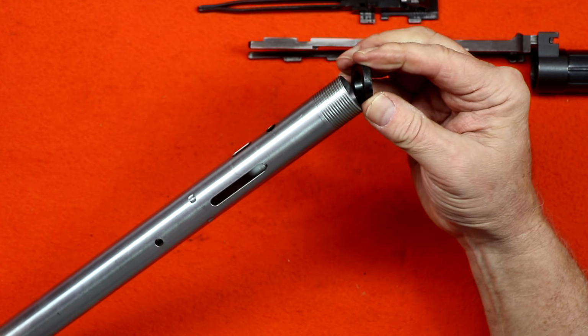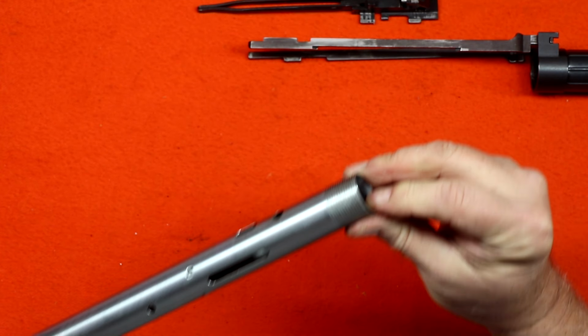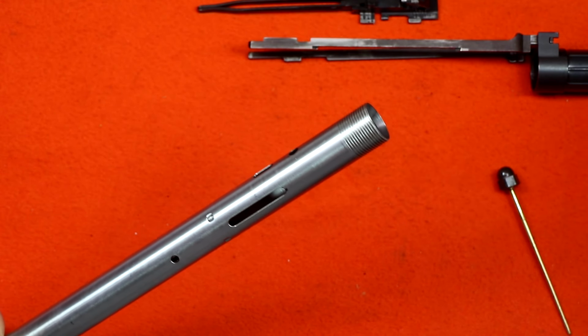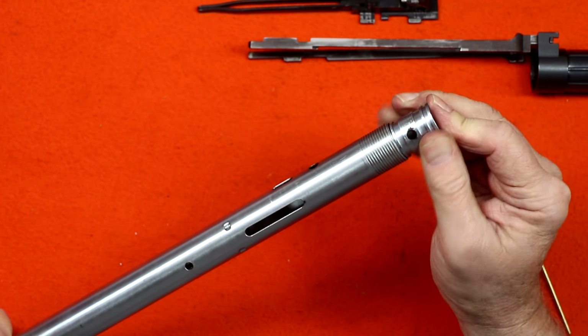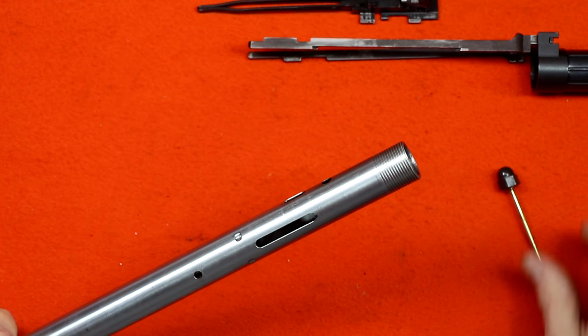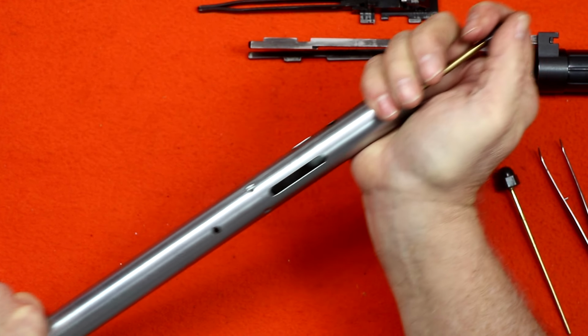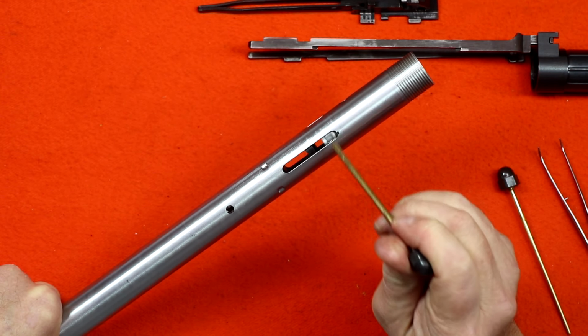The shock absorber fits snugly inside the tube, so once I get it started, I'll use that piston to push it right down against that steel washer, and it will hold the steel washer in place because it does fit snugly. I'll leave the piston and compensator valve out for now until I get the rest of the firearm assembled to the point where I'm ready to put the fore end on.